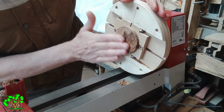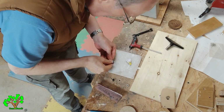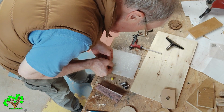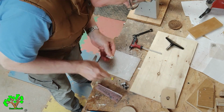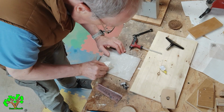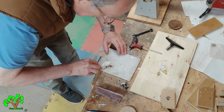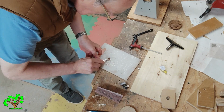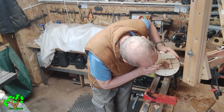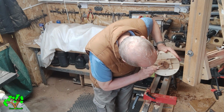Before I do the final finishing, it's time to fill up the severe cracks in the elm blank so that it doesn't fall apart when I start doing further machining operations on it. I'm using the standard procedure of very fast setting araldite, which I'm quite impressed with. It takes less than 5 minutes to solidify, mixing in some sawdust and filling the gaps in the elm blank.